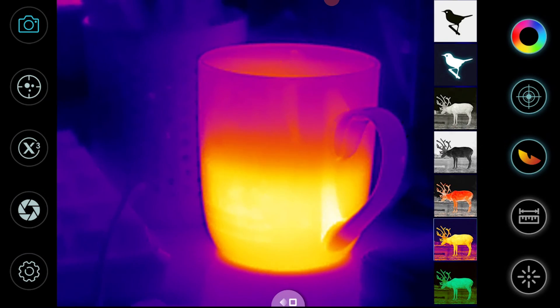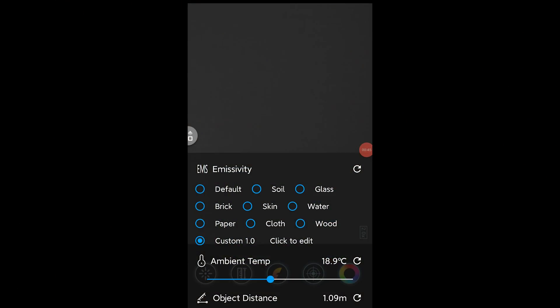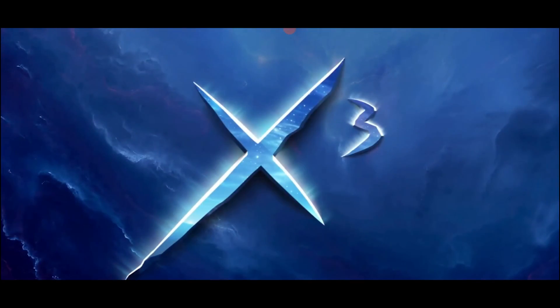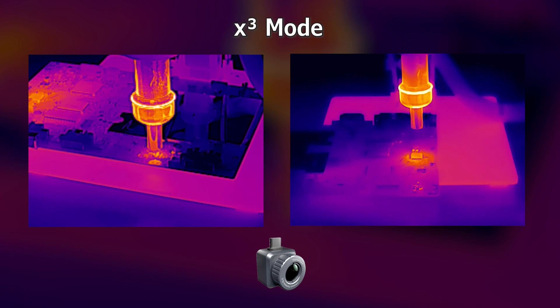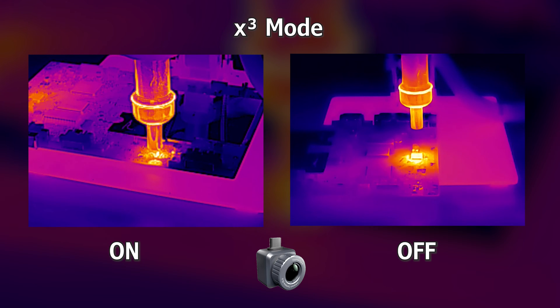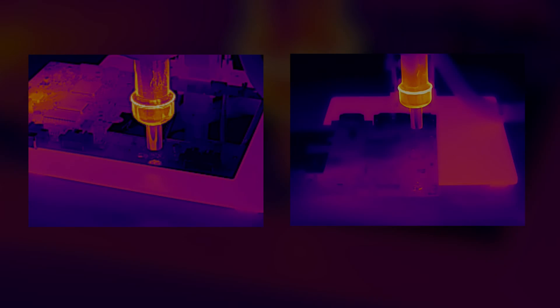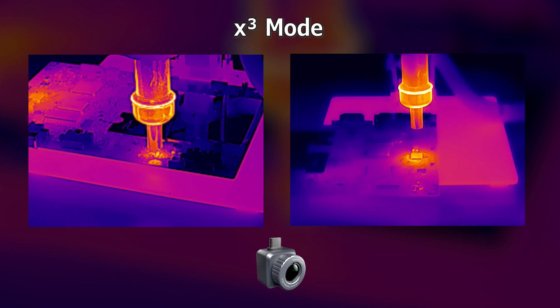You can do your standard colour palette options along with digital zoom and mild image manipulation like mirroring. There are also emissivity settings, which are useful when dealing with shiny objects, but these options seem to do nothing here. Speaking of things that don't work how you'd expect, remember the thermal imager overdrive function where you can seemingly double the resolution? InfraRay claims that this is a higher resolution, however when using it, it has that oil painting AI upscaler look to it. Digging into the spec sheet, the X3 function is listed as a patented image algorithm — does this sound like it is oversampling the sensor, or just doing AI magic? I'd love to hear your thoughts below, as I am perplexed about which one it actually is.